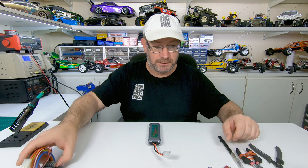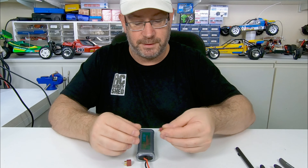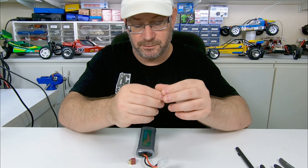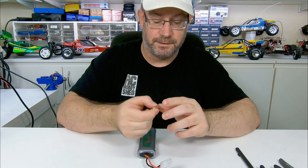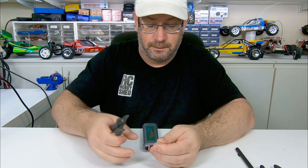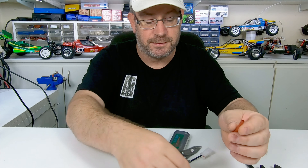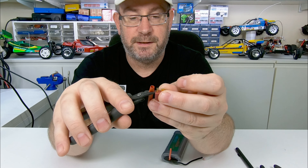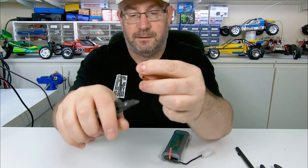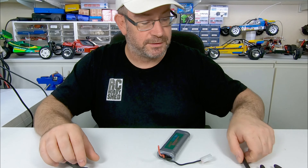We'll start with the battery. For the battery we're going to use a female plug, so you haven't got two bare wires dangling around. We use a female on the battery — the slot that goes across is always the positive side and the one going down is negative. We'll cut off the positive now. First thing you do before you forget: put the shrink tube on. Cut it to size — about there — it doesn't need to be much longer than the little terminal. There's no exact measurement, just eyeball it. If you've got too much it's not going to be very neat.